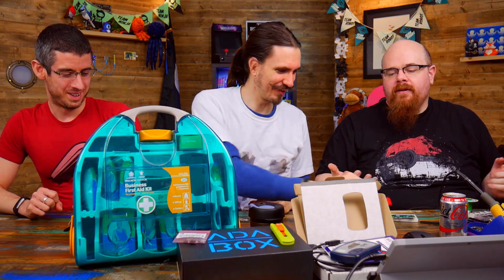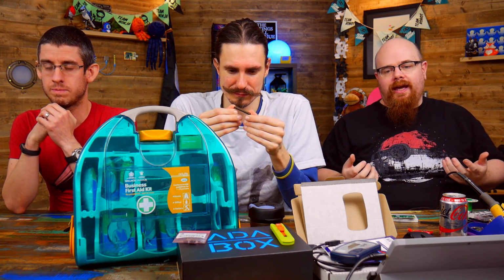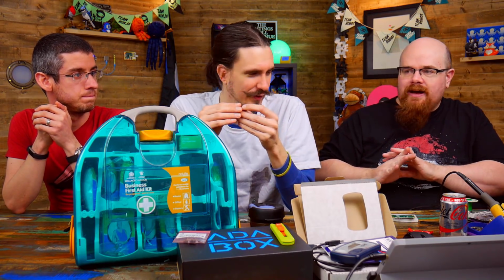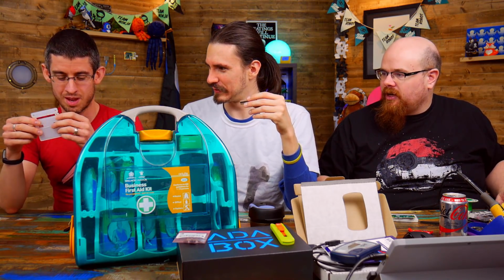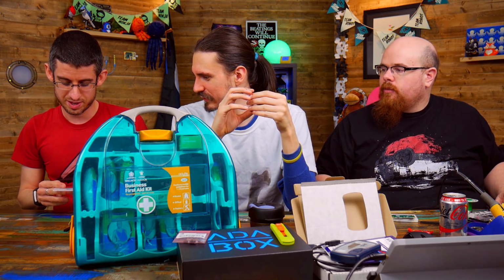Anyway, the way you would normally do it, these are used in industry quite a lot, especially with backplanes and things. And the way they're normally done there is with a precise torque jig that puts constant pressure on and pushes it through. You basically want a constant, even pressure compressing it down from the top, don't you? We have none of that. So what we're recommending is the application of brute force with a hammer or tack hammer. I'm very surprised that that's made out of perspex, actually. Well, if you're hitting it hard enough to break the perspex, you're hitting too hard. It's kind of self-limiting.